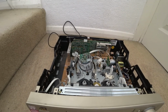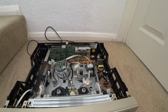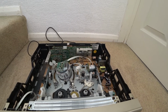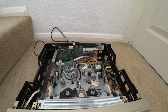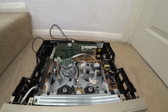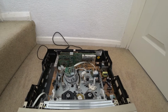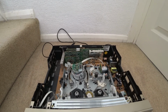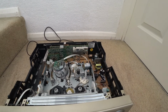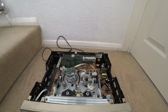I don't know what I can do here, but I studied it a little bit more, and I was able to get some needles to make some holes inside the plastic, and relocate the sprung contact, so it's sat in its original position. After that, I was able to take one needle out at a time and tap in a very small screw, and it has to be really small so it doesn't interfere with the clearance of the mode switch.